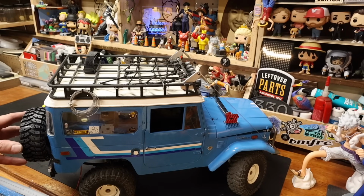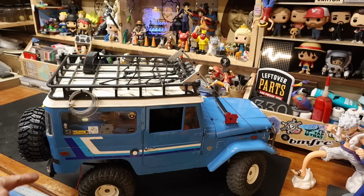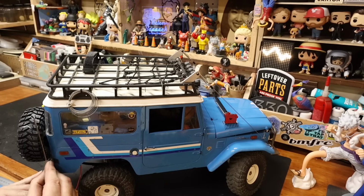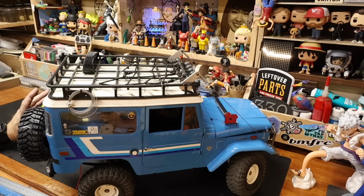That's dang near perfect. Now, what we've got right there is a hole that goes down, and that hole is from top to bottom 17 millimeters, and it goes right into the top of the light. So we can't go past 17 millimeters. So we need something about 16 millimeters long.